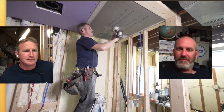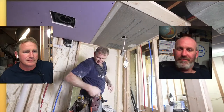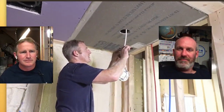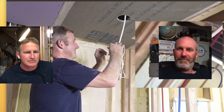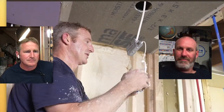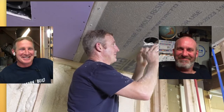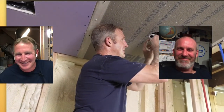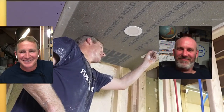I'll grab my wire — these little push-in Romex connectors have just little push-in connectors that make it really easy. You take about three-quarters of an inch off your sheathing and just plug them in — neutral in neutral, ground in ground. I'm setting it on the highest setting for camera work but we can change this out later. Just tuck it back in — these spring clamps make it easy to pop in and out. So there's our light, and we'll get power in here — a light coming down inside our shower.